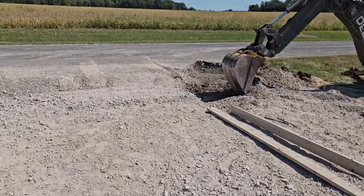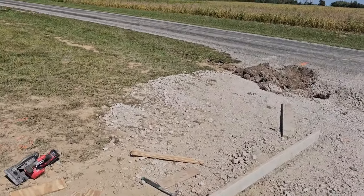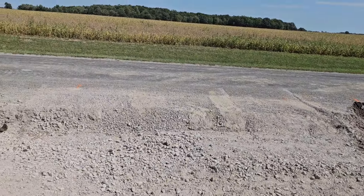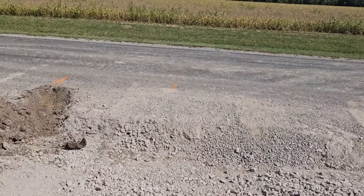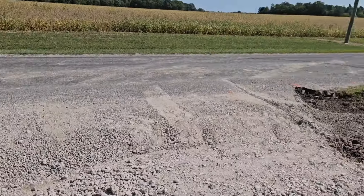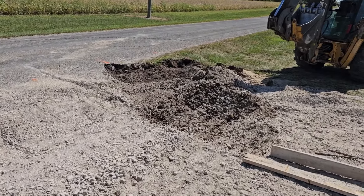This is going to go well, hopefully. We can get this framed up and leveled up and the forms up today. I don't think I'll be able to pour tomorrow afternoon - I doubt I'll be able to get help and concrete lined up that quick - but Wednesday morning should work. We've made a little progress here. We've got the straight part of the driveway kind of formed up and we're working on the little flares out by the road. We're not going to dig all of that berm out and fill right along the road until closer to when we're ready to pour because it's kind of a liability - don't want somebody to hit it.